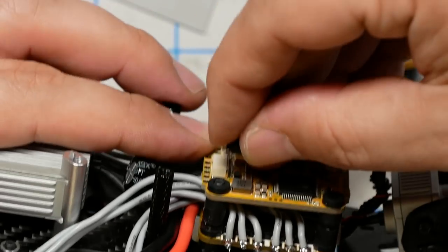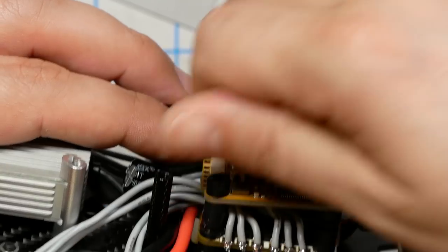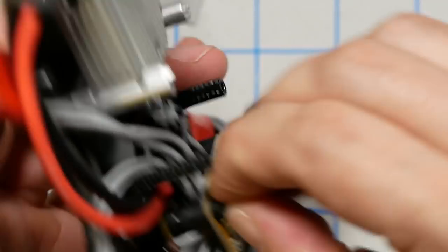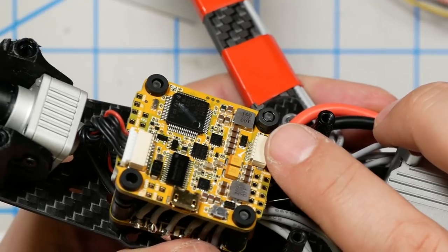We've got the screws here. We're just gonna slightly compress these standoffs and get a screw, get a nut. And I'm gonna recommend you try to get it basically flush with the top of the screw. That'll get enough compression on those gummies that it's tight and it won't back off.